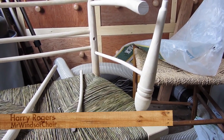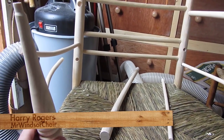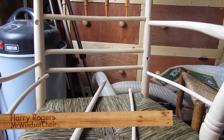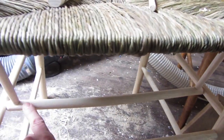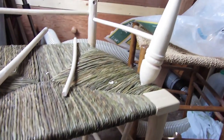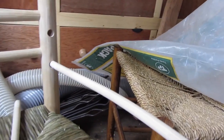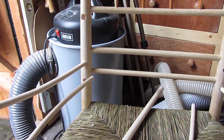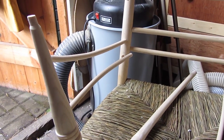I'm doing a trial fitting of the chair components at the moment — these are the arm assembly. I've got my front arm posts and I'm essentially trying to get all the little spindles lined up so I can do the glue-up. There's also the under rail where I've had to do quite a bit of accurate drilling. The holes are all very slightly different sizes because the spindles are all different diameters, but it's going fine and I think I'm now ready for glue-up. I've done a test fit while it's dry so I'm going to go ahead and get the glue on.